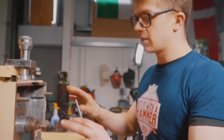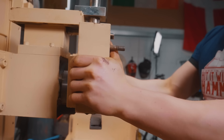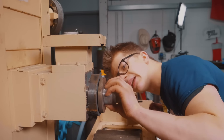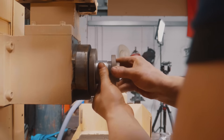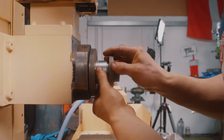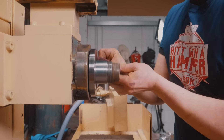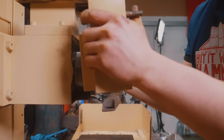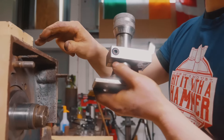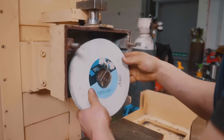In anticipation for eventually doing a surface grinder conversion, I want to crack off this guard. There we go, that comes off. My curiosity is whether we can get this to come off — it's a left-hand thread. That cleaned off the rust with some scotch brite. I'm going to pull the diamond off of this. I don't need the diamond in there, but I want to cover up that hole up top here, so we're going to put this back in place just so that hole stays covered.